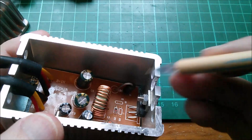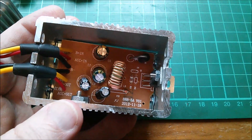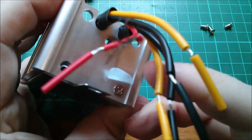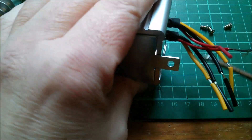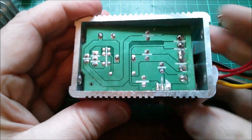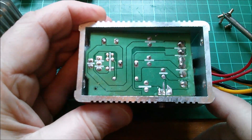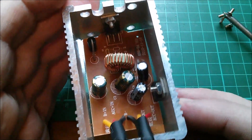I'll take the bottom off and have a look at the underside of this PCB. Rather an old-school SRBP PCB - looks a bit cheap. The final screw is hidden under the quality label. I wonder how much quality there really is in here. There are reasonably wide traces but no attempt to beef them up in any way. There's really nothing much in here.